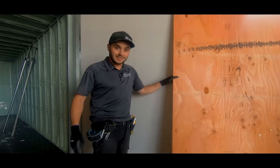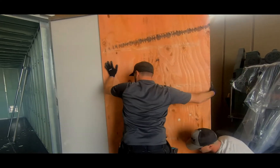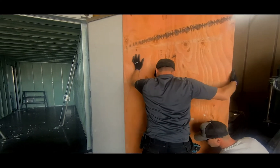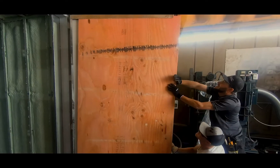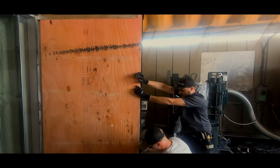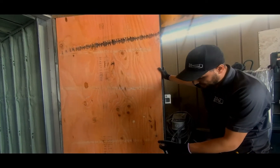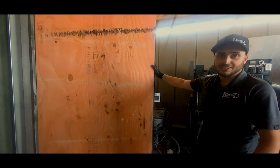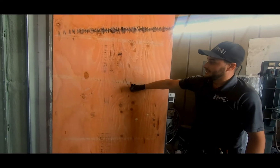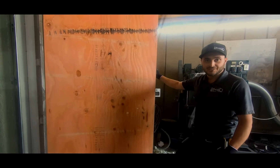Here's the fire-rated three-quarter inch plywood. We just got to lift this up into place and slide it through. Quite a bit of work just to get that spray foam leveled out so these do fit, because it is such a thick interior finish. It was a tight fit but it will fit tight. Once we get all the screws through the flashing into the plywood, it'll be super rigid and just a super clean finish so the doors will operate perfectly once everything's tidied up.